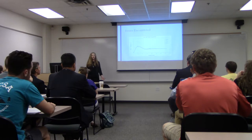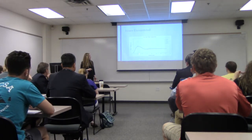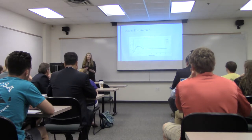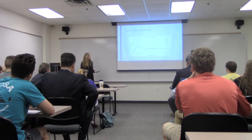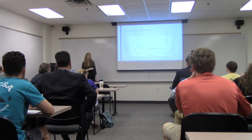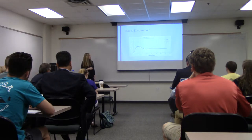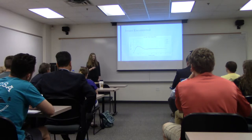A major issue that occurred throughout my entire testing process was that at around 10 miles per hour, the drag coefficient had a serious spike for all three trials of all feature tests. Then it leveled out between about 23 to 71 miles per hour. Due to this phenomenon, I only averaged drag coefficients from that 23 to 71 miles per hour range and excluded this spike in the data.